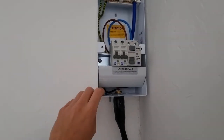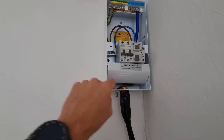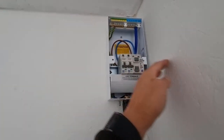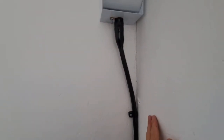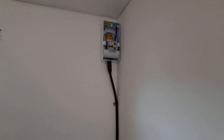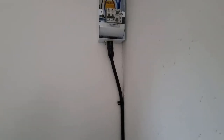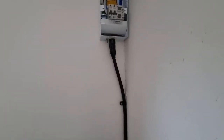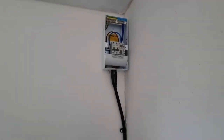That's it - all in. I managed to get the cover back without doing the snip, just got the bend on - just sweet. I've cleated down the side because I was going to go down the middle, but this wall's not very plumb so it would make it look off. But yeah, that's all cleated down. Now we've just got to test it - we've got to connect up the other side and drill through the wall where the consumer unit is. Unfortunately at the moment it's absolutely hammering it down, but I'll bring you back an update.